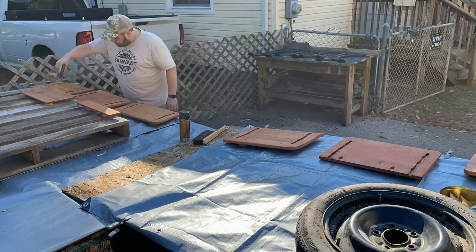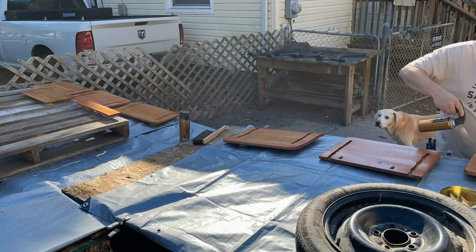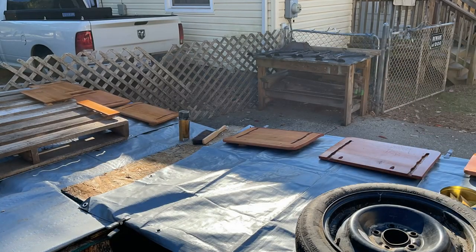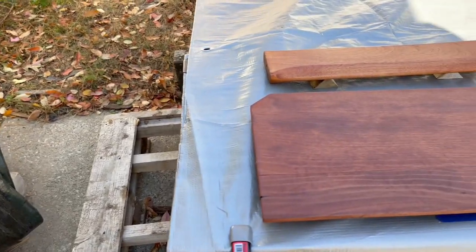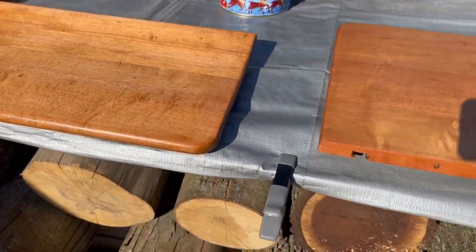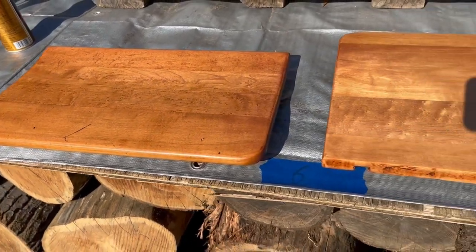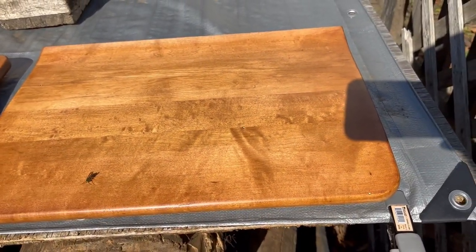And I took everything outside, laid it all out, and sprayed everything with Minwax Polyurethane Semi-Gloss. Everything got four coats of this, just like this, every about 15-20 minutes. And here's, after I've got all of the coats of poly on them, they got a nice sheen to them. Again, this is satin, or semi-gloss. Didn't want too shiny. And right here, this stinking bug, yep.